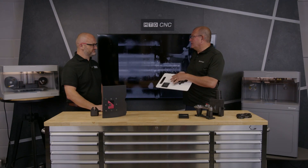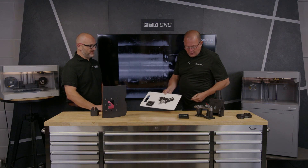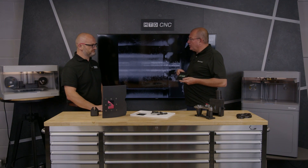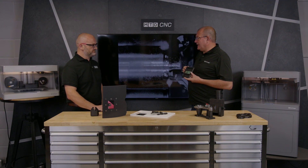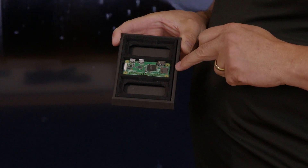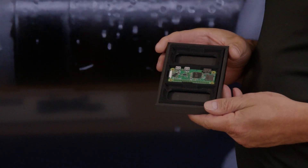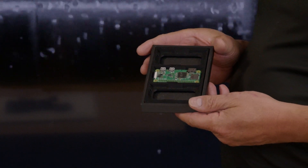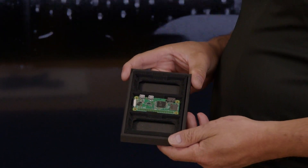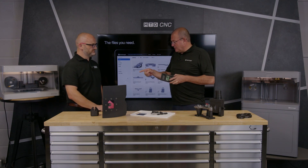Smart manufacturing companies these days are using printers to do the things that printers are good at. There's another material which is Onyx ESD — electrostatic dissipative. Nowadays for assembling things like PCB boards, or in areas where the slightest electrical charge will cause a problem — satellite stuff and similar — this is a great material. In layman's terms: it's anti-static.